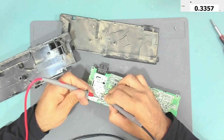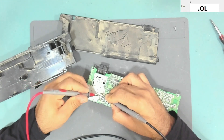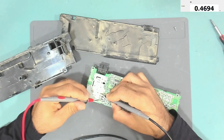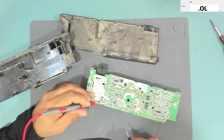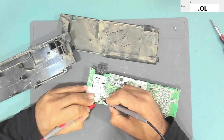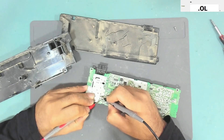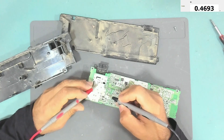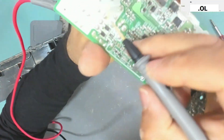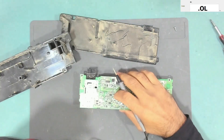As you can see, we have a short circuit on one of the AC side pins. The other one gives a good reading of 0.4. Checking the negative side — that's good. Now with the positive lead at the negative of the bridge rectifier, checking the AC side: both pins are good. We only have one problem: the positive side to one AC pin shows a short.